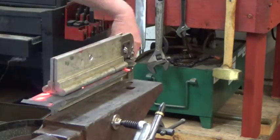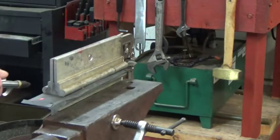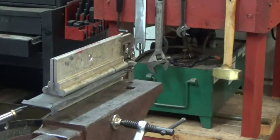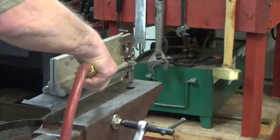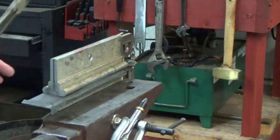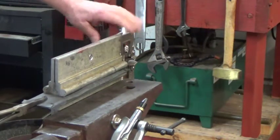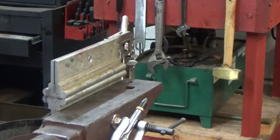There's Craig's knife. Now we're out of that critical stage where it can really warp, so we're going to take this one out. This is hot to the touch now — I'm going to drop this down in the oil just to complete its cooling.